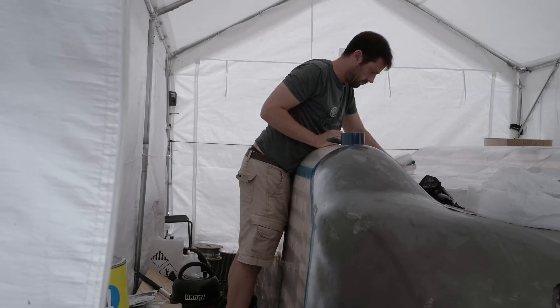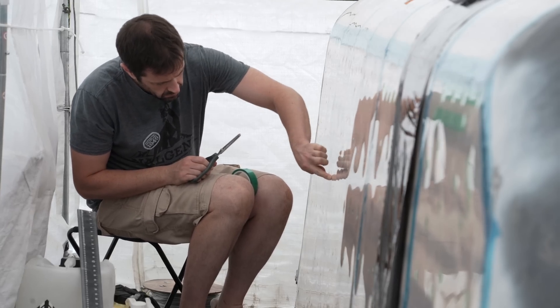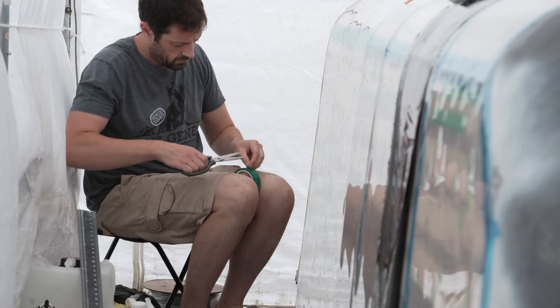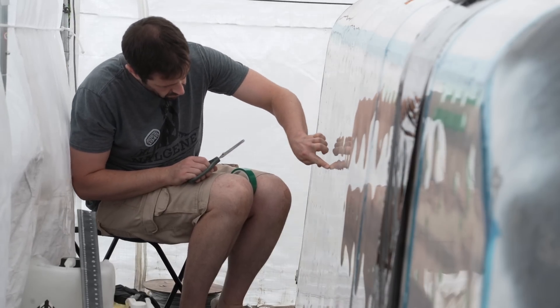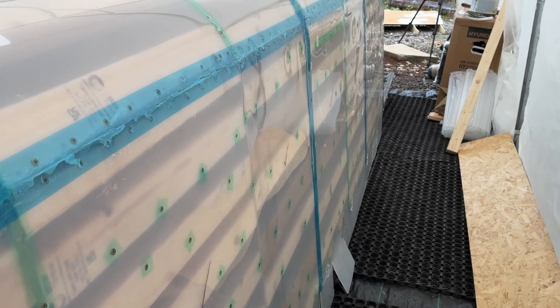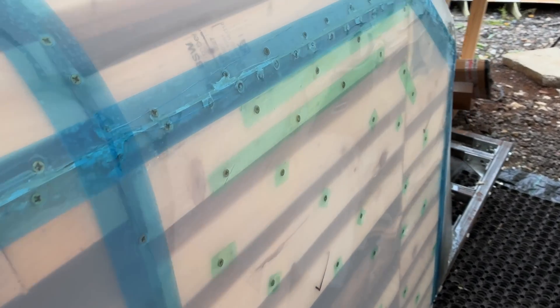Along the very bottom, I'm going to have to go with a reinforced tape edge, because the vacuum will need to be sealed along the whole bottom edge as well. If that's done properly, I won't have any issues later in the day. If I try and rush it, we'll end up introducing problems and dramas. On laminating day, you do not want to find out you've been lazy in previous jobs and have created extra work for yourself — possibly losing materials, a failed part, those sorts of nightmares. So this is the point where I make sure I do this properly. Lots of opportunity to listen to some politics and history podcasts as I carefully attend to each and every hole or join with flash tape. I'm mostly grateful that the heatwave of May and June is over. The little tabs and strips of tape are done, and I think we have a totally sealed surface.